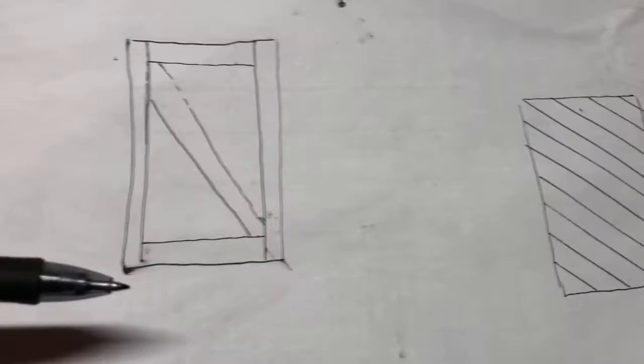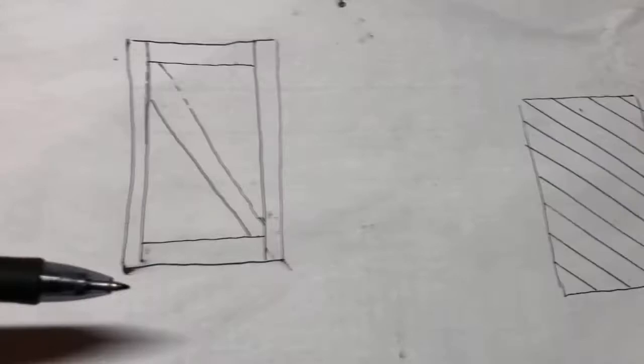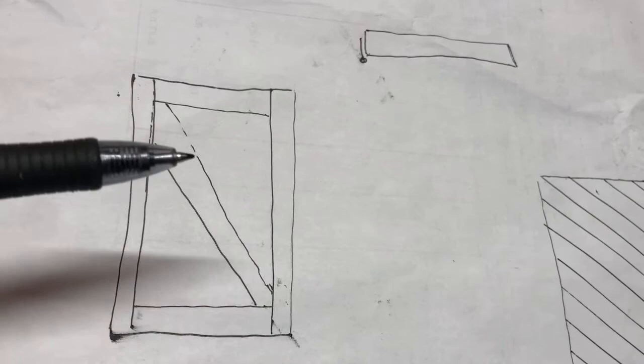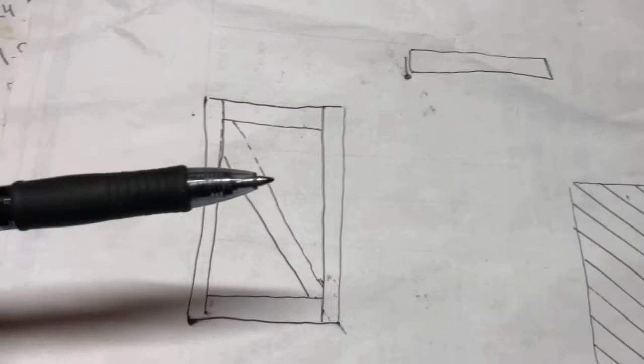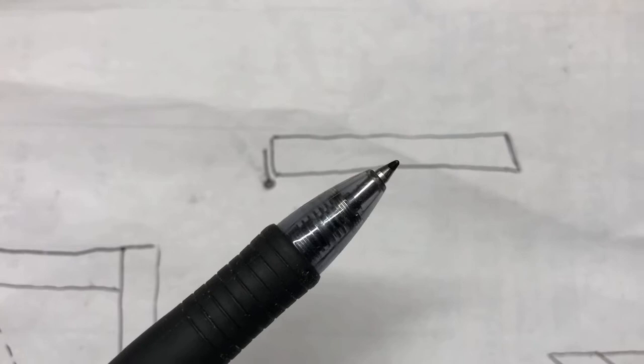So this is gonna be our basic frame - regular two-by-four - and we're gonna put a diagonally-placed board in there to help with the strength of the door so they're not gonna be moving side by side after a little while. This is like a structural diagonal support brace. The door needs to be beveled - this is a view from the top of the door.